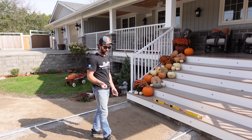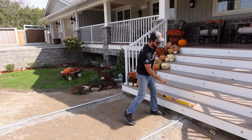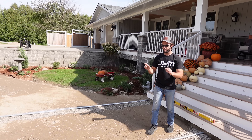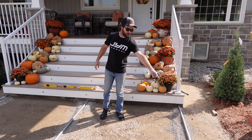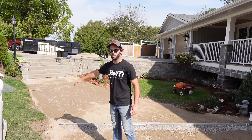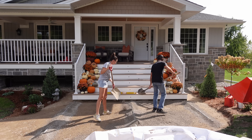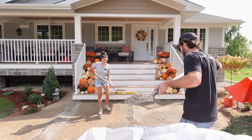What we're using is actually one-inch gas line, because you should have about one inch of the gravel underneath - so it works really well for that. I set those up level and kept the paver just a little bit higher than where I want it, because they're going to get tamped a little into this gravel. I did the same thing over there, set up level in front of the stairs where it's going to land, and ran a string from the furthest point to the corner - a parallel line to set up the slope going that way. I did about an eighth of an inch slope here so all the water is going to go away from the house. We're going to leave the border about six inches away and put some kind of river rock. I learned everything from the Christian Hardscaper - shout out to him. I watched like hours of his videos.